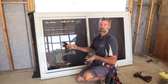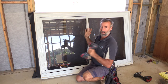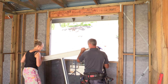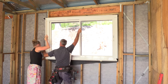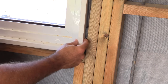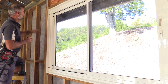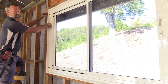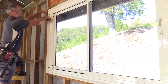Make sure all your flashing is pulled out so when you put it through the opening the flashing doesn't get caught up. It can be a little tricky — it's actually easy to install these from the outside so the flashing just pushes against it, but for this purpose I'm just going to put it in and slide it back. Once the screw is in just below the packer, that's nice and solid. Then on the other side it's simply a matter of screwing off, finding packers that fit between the gap — mine work out to be a 10 mil packer that I can just slide between the stud and the reveal to get it nice and firm.